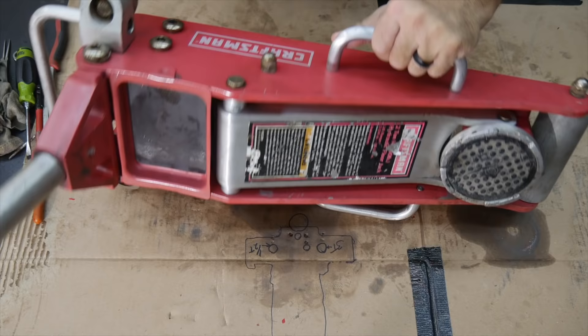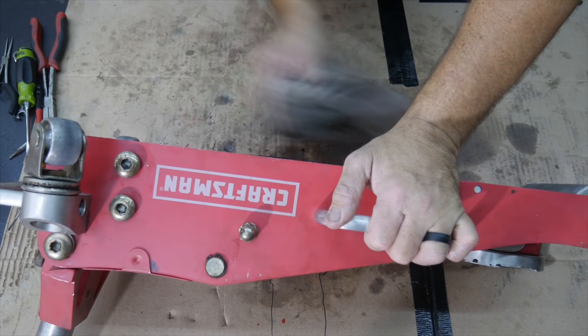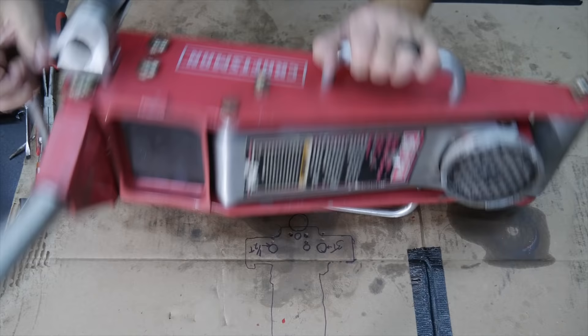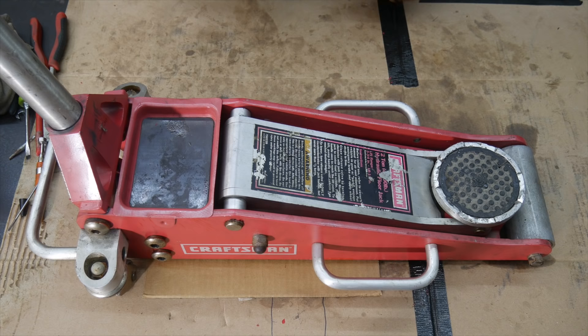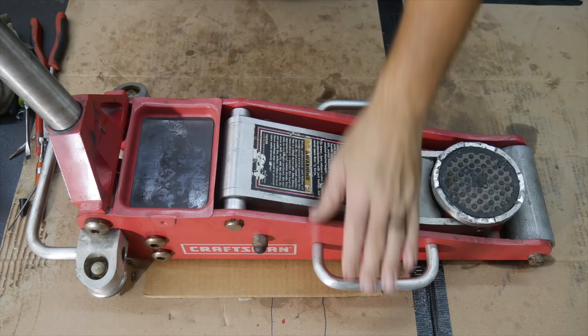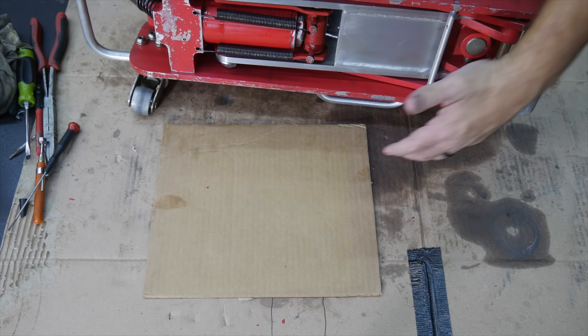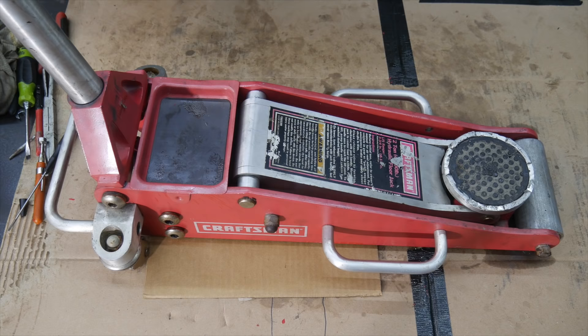Here's a little bonus tip: when I'm done cleaning or fixing a jack, I'm going to degrease it really good and wipe it all down so there's no residual oil. Then I'll take a fresh piece of cardboard, slide it underneath, and let it sit overnight. When we come back the next day we can see if we have any leaks - are we leaking when it's non-pressurized, with the handle open and everything just resting. When you pick it up you should be able to tell where it's leaking from, rather than just being a big blob of oil. You can see primarily where your drip is - leaking out of the front of the ram, the back of the ram, or back in the valve system.